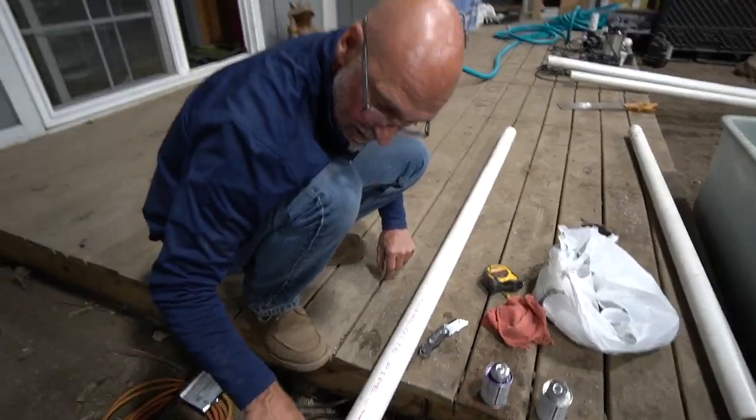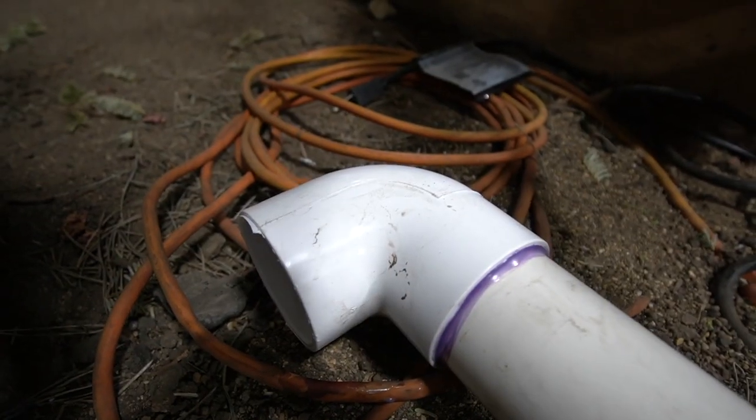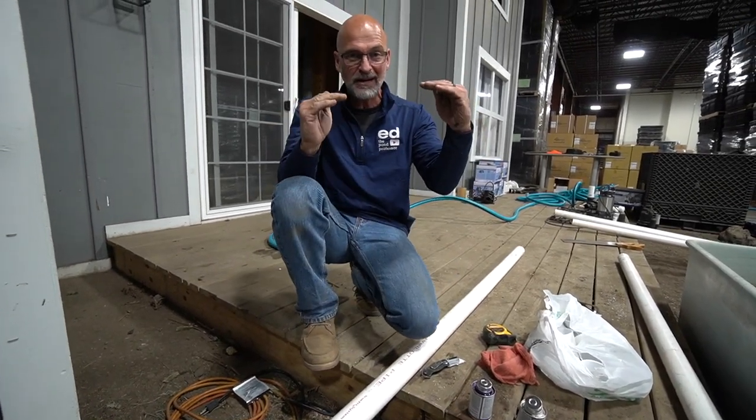You can see these lines here — you can see how the pipe is marked. This is set at the apex of that edge, so you can see where that seam is. I'm going to glue this one right at the center line, slide it down, and glue that piece. I know everything is going to be good, especially when you have lots of elbows — you want to be super conscious. If it's tweaked down a little bit or up in the wrong direction, it's going to start sending your pipe off in a different direction. So everything's got to be in the same exact plane, otherwise you're going to have problems. If you're doing your pond on your own for the first time, be super conscious of this — take your time and make sure all these different things line up. All right, let's start going up.